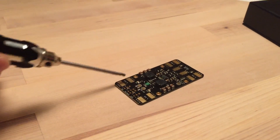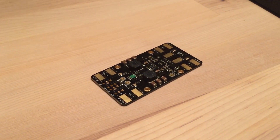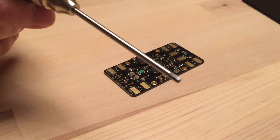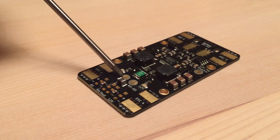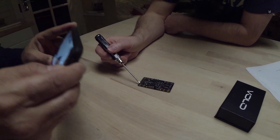We've doubled the copper thickness — it's a four-layer board. In terms of current, we've tested it and 32 amps continuous per output is pretty safe, and it'll handle 50-amp spikes no problem. With four outputs that's potentially 200 amps total, which isn't really going to happen on any quad. We're confident it's never going to melt or have any issues. If you're running on 3S, there's also a little tab on the side to disable the 12-volt regulator since it won't be needed.